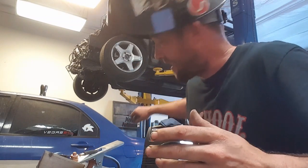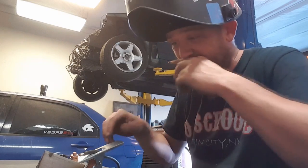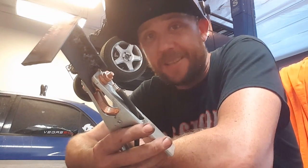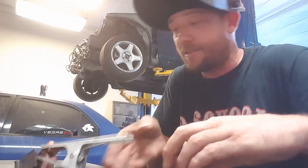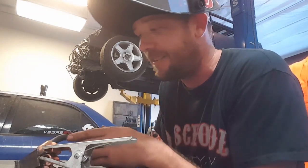If there's one good piece of advice I can give for anybody who's new or not used to MIG welding, or just practicing or trying it out, it's this: if your machine is making all those funky noises and not laying down a nice bead, or you're getting results like this, don't keep welding it. That means there's something wrong with the machine, something that's not set right. It could be your leads are backwards, wire speed's too high, wire speed's too slow, or voltage is too high. All you have to do is stop welding and try again on a different setting.